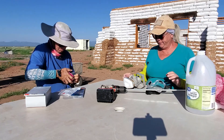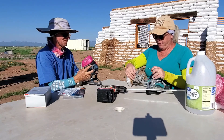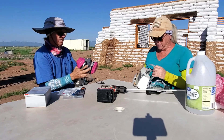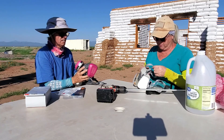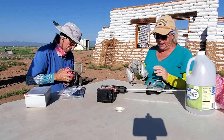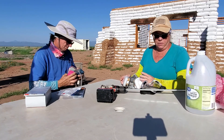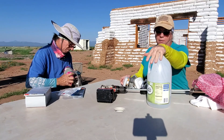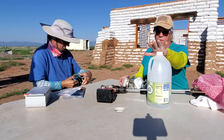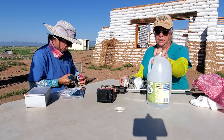Okay, we're getting ready to mix our lime. We've got to take some safety precautions — using some heavy-duty face masks, we're going to do some eye protection. Don's probably going to do a face shield. And we need to have distilled white vinegar available in case we get any of this stuff on our skin during this process, because it will burn and the vinegar will neutralize the powdered lime.